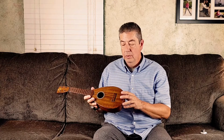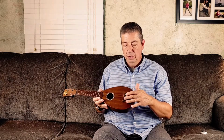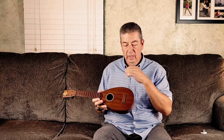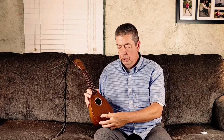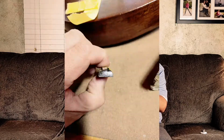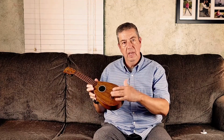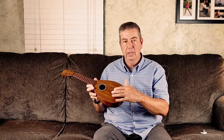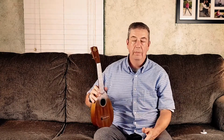And what I ended up doing, I couldn't make a caul like I've done with other things that would go over the saddle because it's so toward the front and there's really nothing in front of the bridge. You'll see this in the photo. So what I ended up doing was cutting a little piece of wood to use as a shim behind the saddle that was just a little taller than the saddle, that would enable the clamp to grab right on the center of the bridge and pull down. Well, 2 clamps in this case. And that worked really well.